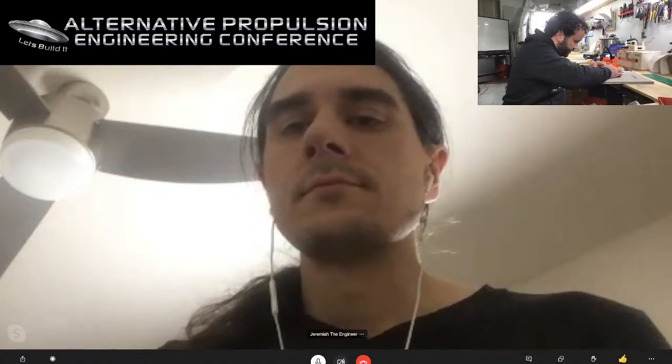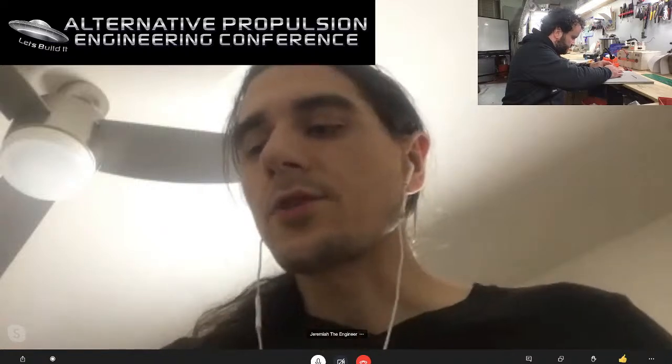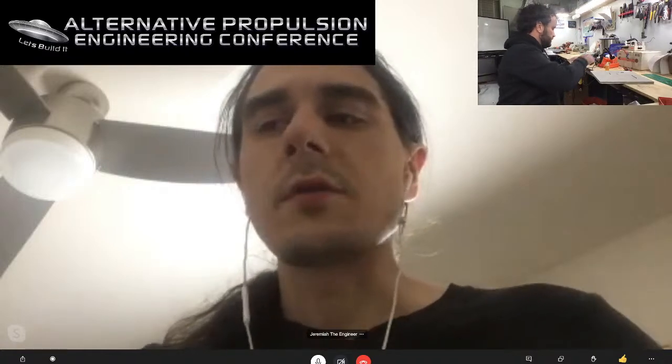And the current draw should be coming from the motor, not from the high voltage, right? Exactly, yeah. Once the disks are charged up, there shouldn't be any more power furnished by the high voltage power supply. At that point, power stops flowing from that and it just sits there idle, and the motor should be entirely responsible for furnishing all the propulsive force.